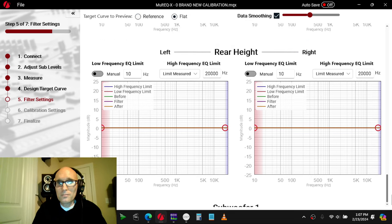And you can make judgments right now on which is actually the best. So I'll try and get as close to 40. So align phase at 40. There is some misalignment here, but we're optimizing a bit further into this area now. We could do a 50. Can I get 50? Yep. Align there. Now, as you can see, 50 really does align everything perfectly up to about 37. So generally speaking, it might be the safest way to go here.